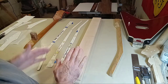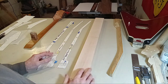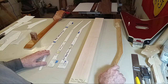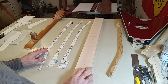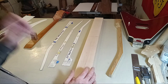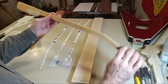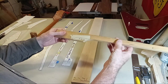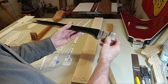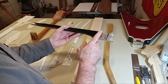All right, so let's say you're going to go my route, and you're going to do either a 25.5-inch scale, a 25-inch scale, a 24.75, or a 24.562. I'm not going to say it's irrelevant, but it's personal choice. The thing about that is, by choosing your scale, we're going to have a certain location where the neck is going to join the body.